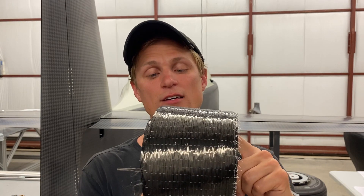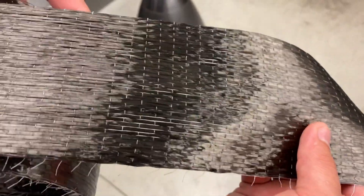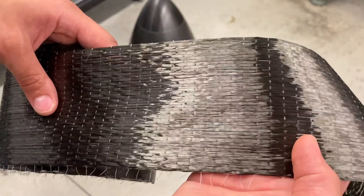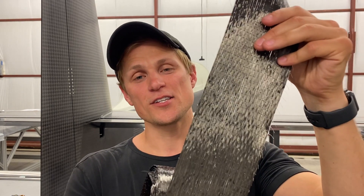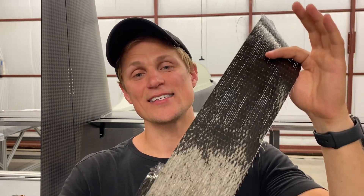Some parts of the aircraft, like the wings, horizontal stabilizer, and vertical stabilizer, require additional reinforcement to withstand the aerodynamic loads they experience. In those parts, we add additional layers of unidirectional cloth to help handle those flight loads. This cloth is very strong in only one direction, since it has basically 100% of the fibers all oriented in one direction — very strong in the fiber direction, with minimal or zero strength perpendicular to that. So we align this cloth with the stresses in the part. For example, the lifting loads on the wing try to bend the wing upward, producing internal stresses aligned with the wingspan direction. We add extra layers of this unidirectional cloth into the wing skins aligned with those stress directions, which helps strengthen and stiffen the wing against bending.